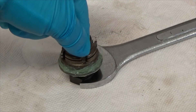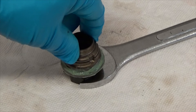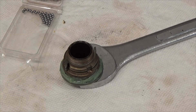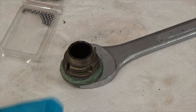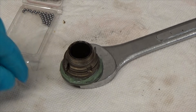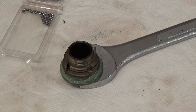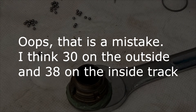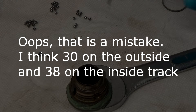Next are the ball bearings, and that's going to be fun. I have them divided out and I'll just put them on one by one. I'm not going to use a magnet because the ball bearings will stick to the magnet more than the grease — it's a tedious job. I'll just do them one at a time, maybe picking them up with a little grease or with my fingers.